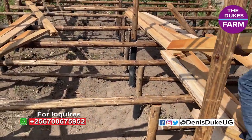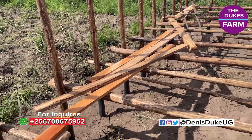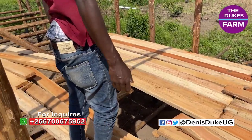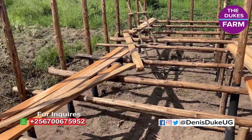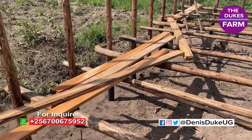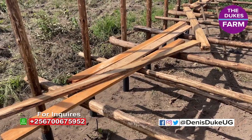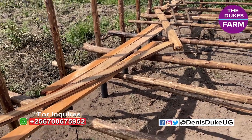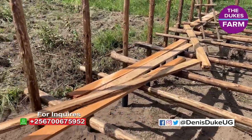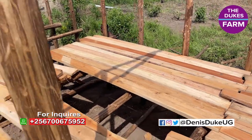Now, something I did not tell you a little earlier, I'm going to show you, is that this is our raised structure. This side of the structure has been raised roughly around 4 feet. This other lower side has been raised roughly around 5 feet. The difference in the raising is because we wanted to have a flat, leveled floor. The land wasn't leveled, it has some slope. So we had to find ways of having this floor of ours balanced. That's why here we have about 4 feet, while this other side we have about 5 feet high from the ground.